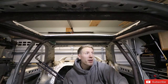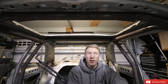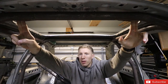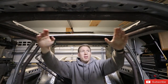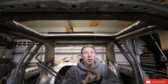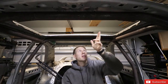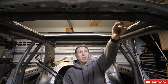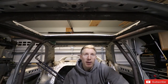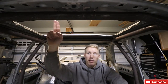The V is going to pick up right around here on the windshield bar and then come together right here on the main hoop - that gives me plenty of clearance with my head because they're going to bow up to follow the roof line. I just need to figure out exactly what my measurements are going to be. They should be simple to make - just straight from here to here with one slight bend. I might do the bend in the center so the notch comes up and then angles back down, but I'm not sure yet - I need to look at it more.